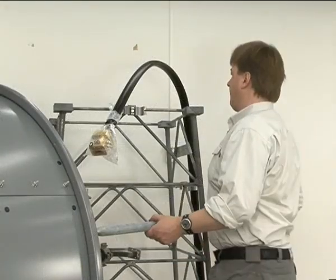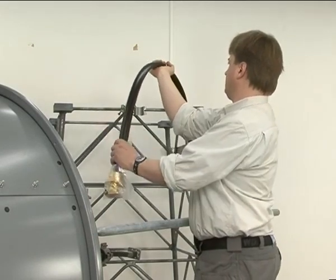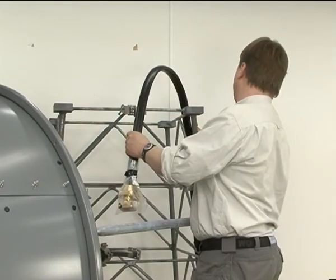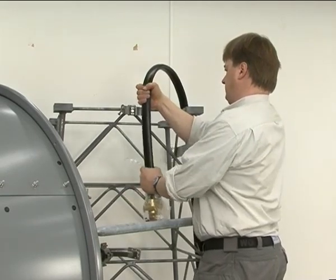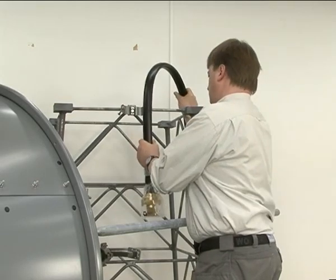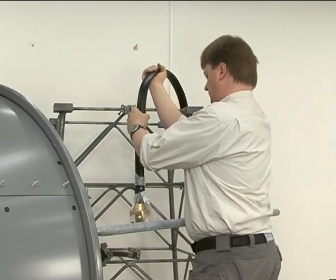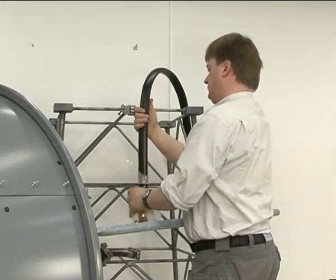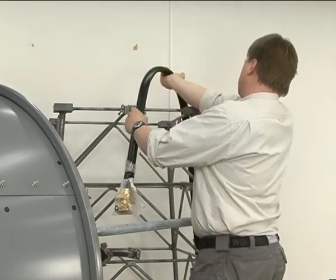You can't twist this type of waveguide, which means that the end of the U-bend must be close to and in line with the end of the flexible waveguide. Form the U-bend slowly and carefully by making small bends along the length of the waveguide. Too much bending, especially in one spot, can destroy it, so be sure to follow the manufacturer's bending specifications. Make the bend tighter bit by bit.